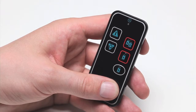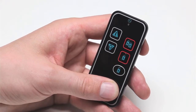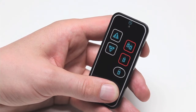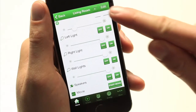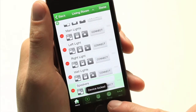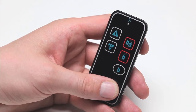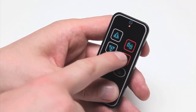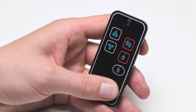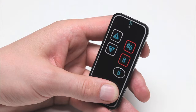The locker is a small handheld remote which locks or unlocks any LightwaveRF socket, dimmer, or plug-in that is linked to it. This can also be achieved using the LightwaveRF app. To lock a linked LightwaveRF device so that the manual buttons don't work, press the lock button on the LightwaveRF locker. If locked on, the device will not turn off manually. If locked off, the device will not turn on manually.